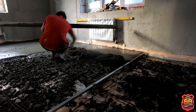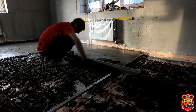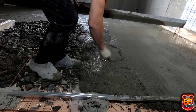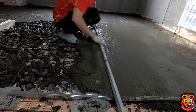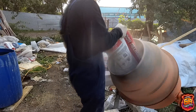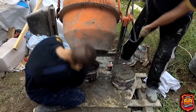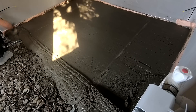By forming large piles of ready mix and spreading them with a trowel across the area, I pulled with the rule in the planned direction. The big downside of thick mortar is that it's very hard to pull, but the result is significantly better — thin mortar causes depressions or puddles that are hard to correct. So I worked with thick mortar: it took more time, but while I was pulling the rule, my partner was already mixing the next batch, then bringing it over. The work was continuous. After half a day, my partner Anatoly had fully mastered the mixing proportions, and I just kept spreading and leveling.